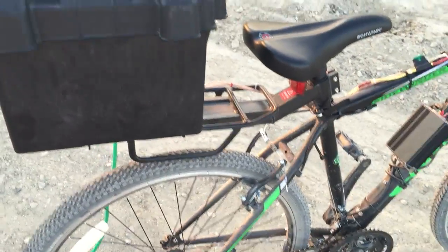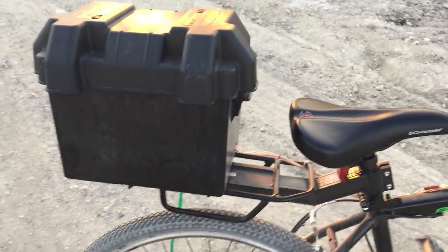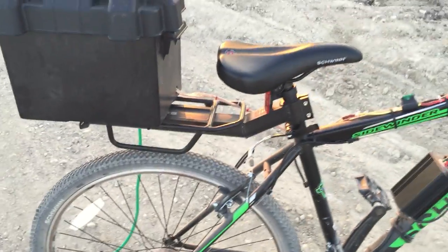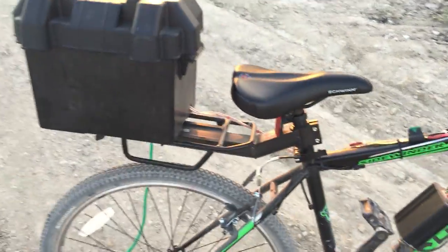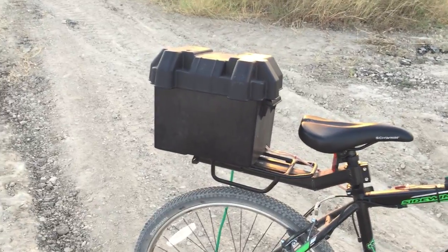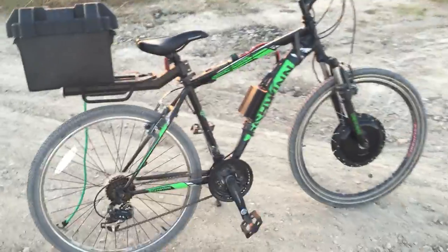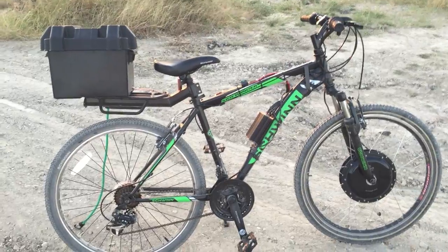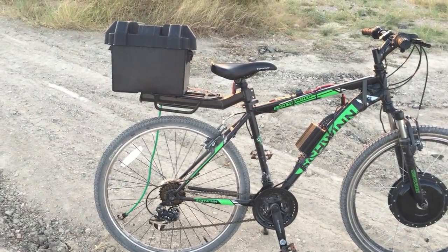As far as the capacity, they're used lithium-ion cells, but I'd guess somewhere between 10 amp-hours on the real low end and 20 to 25 amp-hours on the high end. So far I've only been able to pull about five amp-hours on an average run. I charge these all in parallel with a Turnigy Reactor charger — that's a 20-amp charger — and I charge at 4 amps per pack, getting a full charge in about three hours. Yesterday I went on a 12-mile ride, came back, let the battery sit overnight, charged it the next day, and it took 20,000 milliamps. Divide 20,000 by four packs and you get about five amp-hours per pack.